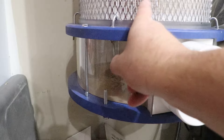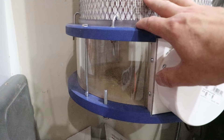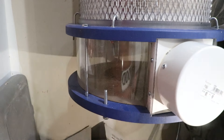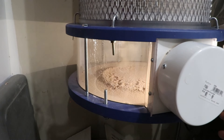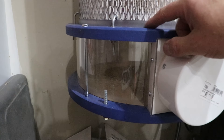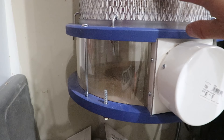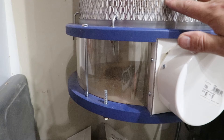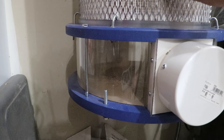I went around with my air hose and blew through here to blow out any dust caked on the inside of this filter, then let it settle to the bottom for a few minutes. All that down there is sawdust — if it's shining light through there, that is all fine dust. You're still going to have a bunch of fines in there, which reiterates my whole point about why caulking this is bad engineering, because these filters get caked pretty fast. I can blow it out with the air hose a bunch of times, but at some point that's not going to work, and I'm going to have to replace it or do a more thorough cleaning to keep the system running at optimum performance.